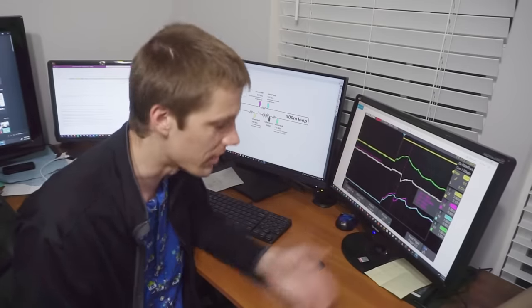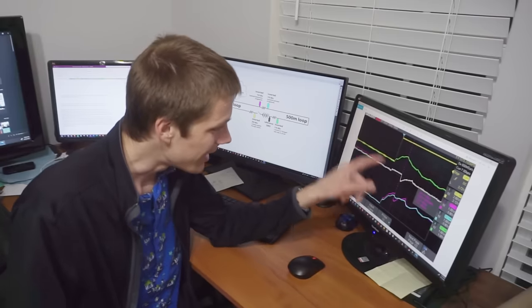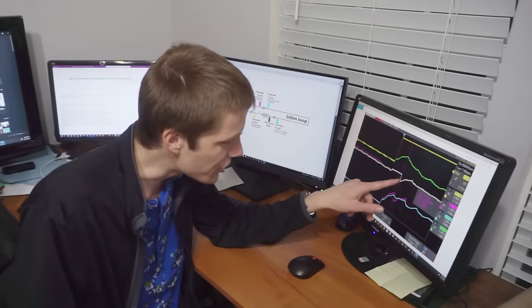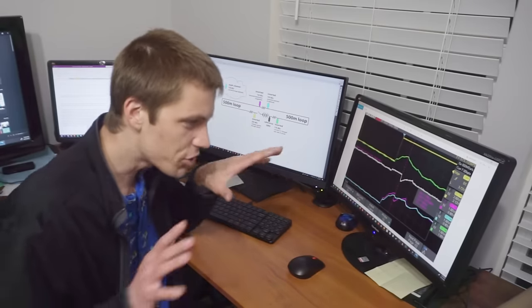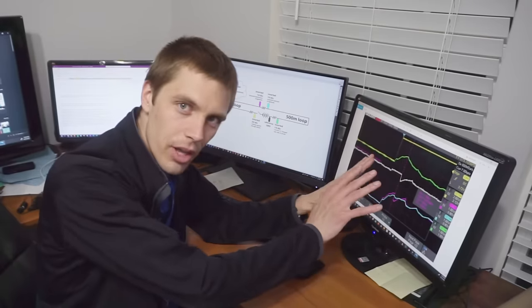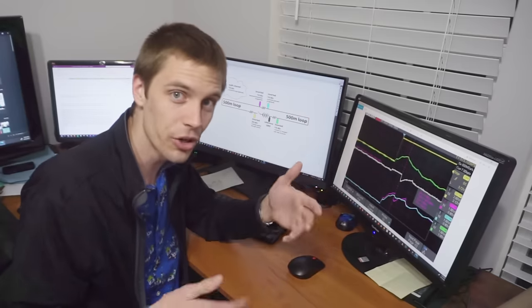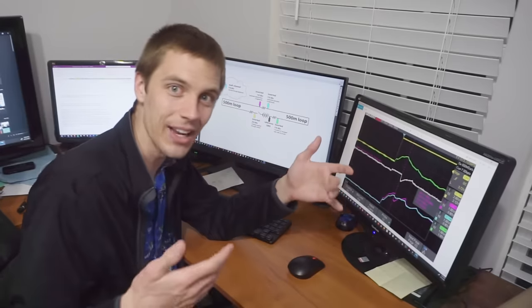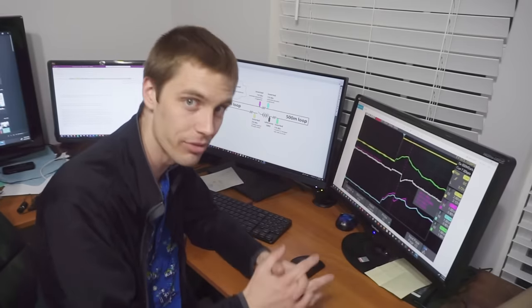The most interesting thing about this plot is actually the fact that the white trace reverses briefly. That means that we push a whole bunch of current through the light bulb, but then when it runs into the ends of the wires that are cut, that current actually sort of sloshes back, and we get electrons that are bouncing back and forth on the line like a wave through a slinky.